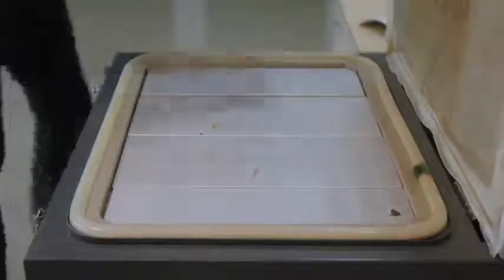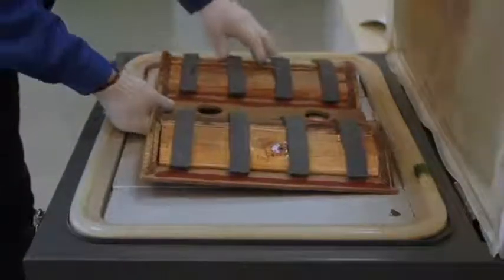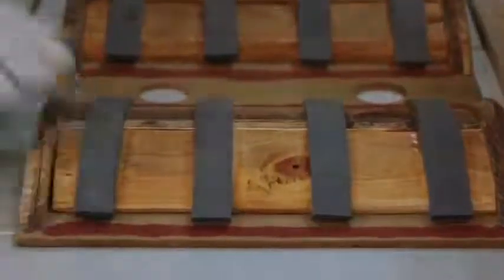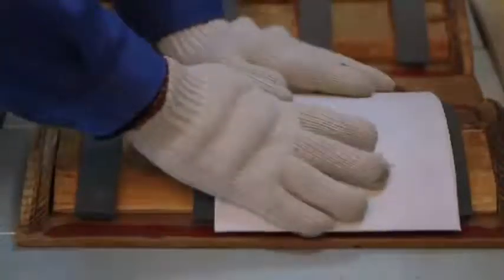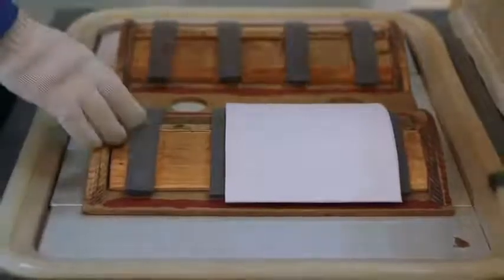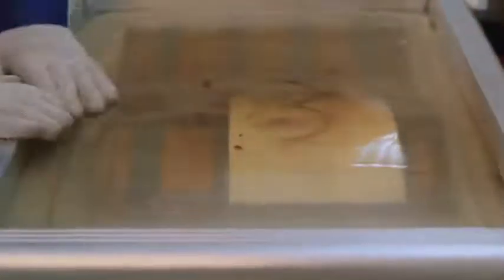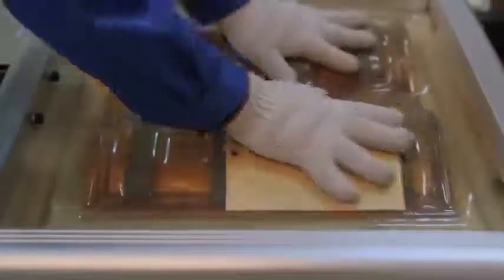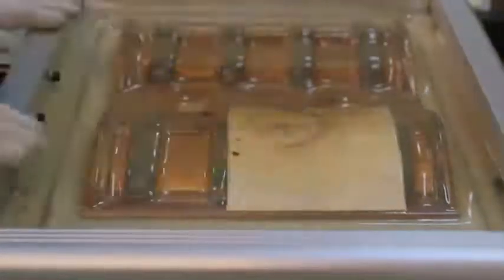The surface of the glass has a very high degree curve, which creates a large gap when using this machine. In order to prevent the machine from crushing it, we need to use a fixture. Turn on the vacuum engine. This product needs about 4 minutes to be finished, or whenever the temperature starts to reach 195 Celsius again.